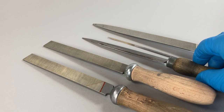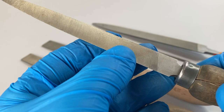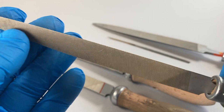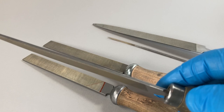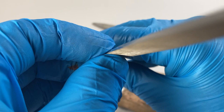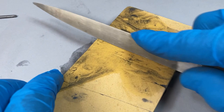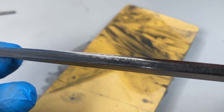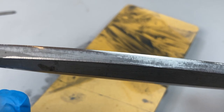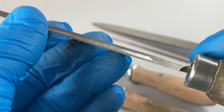The next file is something a bit more unusual — it's called a barrette file and it's incredibly useful. The problem with hand files is you can't really file into corners; it seems counter-intuitive because you'd think a square corner would be useful, but the swarf gets stuck in the corner. The barrette file is relieved to be quite sharp in the corners, which you sharpen further by stoning in the same way as the hand file, bringing the edge of the teeth right to the edge of the file. It's brilliant for getting into corners.